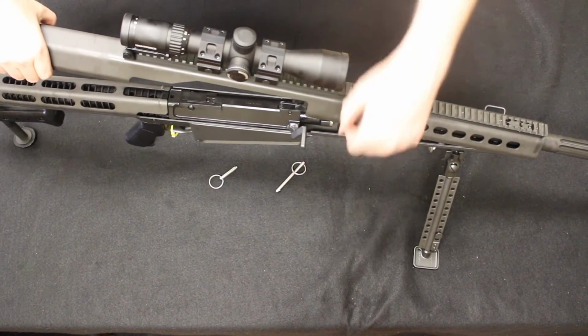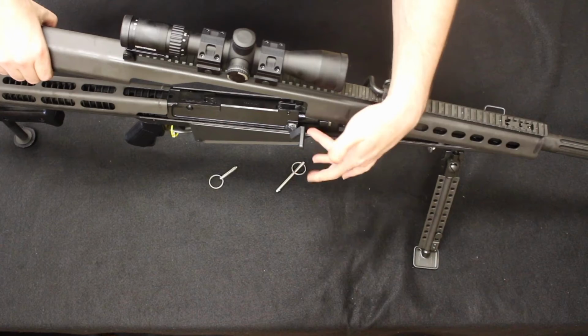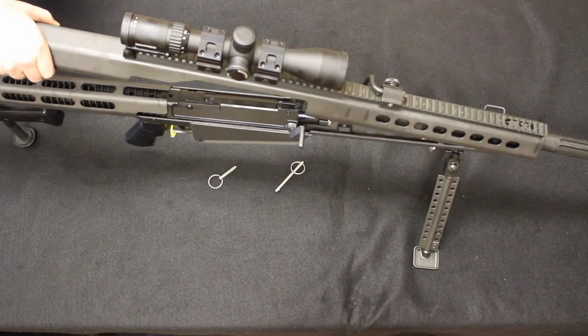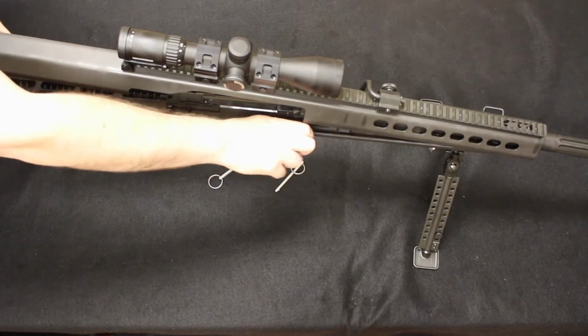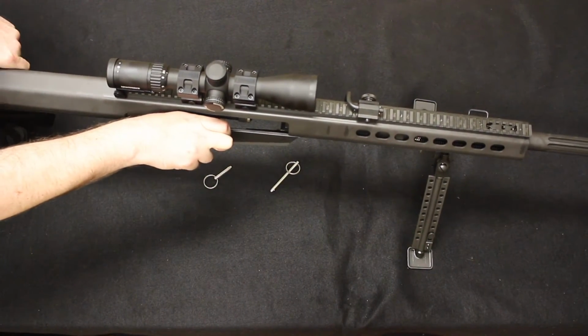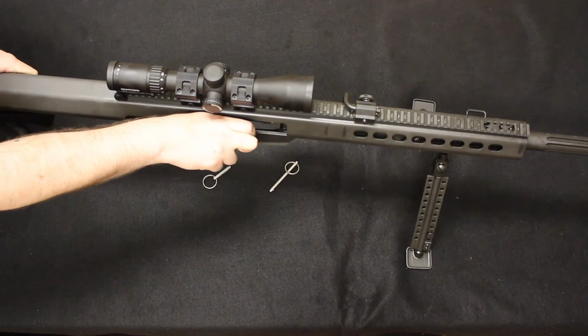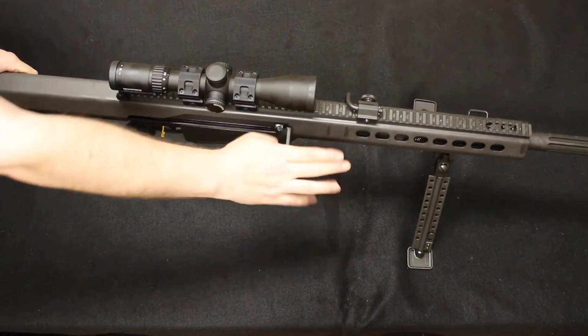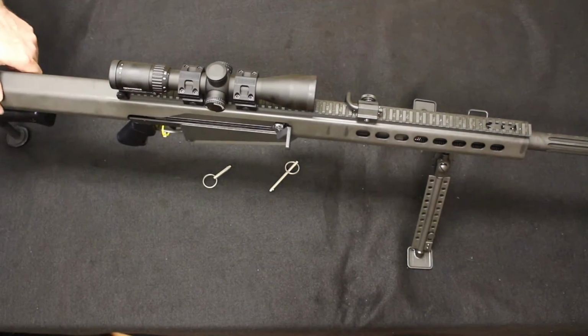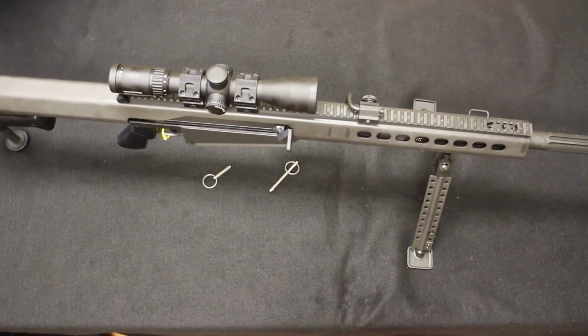Now here I will have to bring back the bolt slightly so it'll allow the top half to completely come down on top of it. So I'm gonna shift over here and bring this back about halfway. And that'll allow the entire top half to sit down on the bottom. But I can go ahead and release that, and now it's set. The bolt head is now locked into the trunnion. So it's locked in place. I can't lift it anymore.